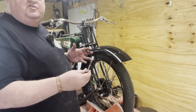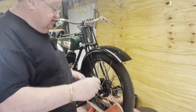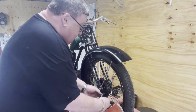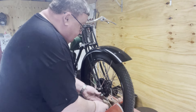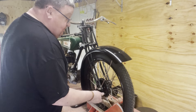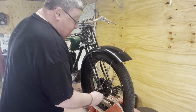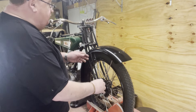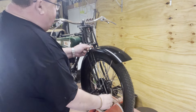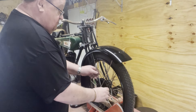Now I'm fully cognizant that I shouldn't have, and you can't see much because it's not great, but I did. I heated it and gave it a little tweak. I tweaked it to get it to line up better so that the rod pulls straighter. I've failed before where I've heated cast parts and it's always a bad idea - so I did it again, not sure why, but I wanted to. I've given it the tiniest tweak inwards, that way, because I want to use the full length of the rod. And because the rod slides in a tube, I want it to not bind. When you get it going straight it won't bind.